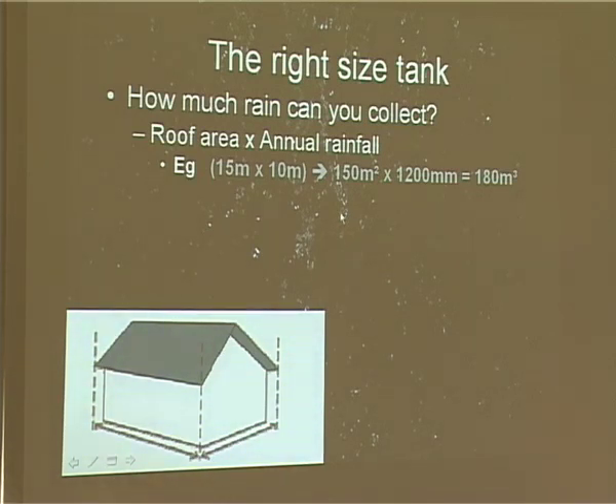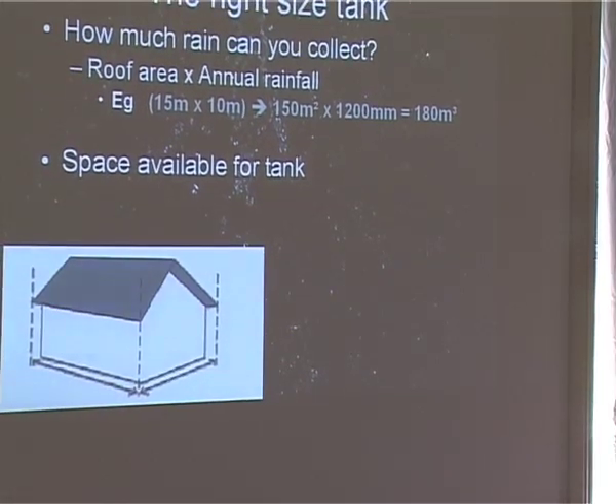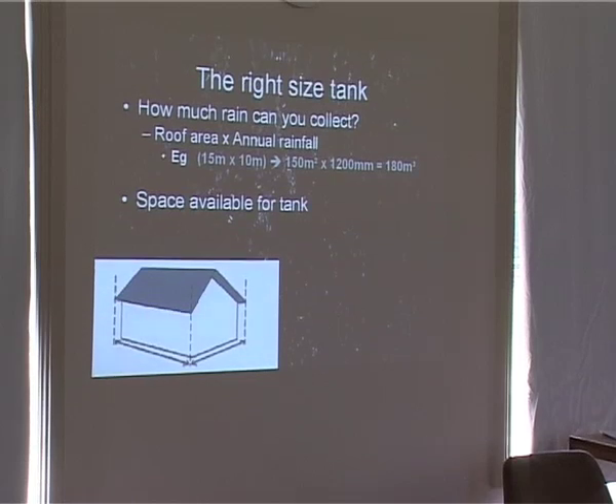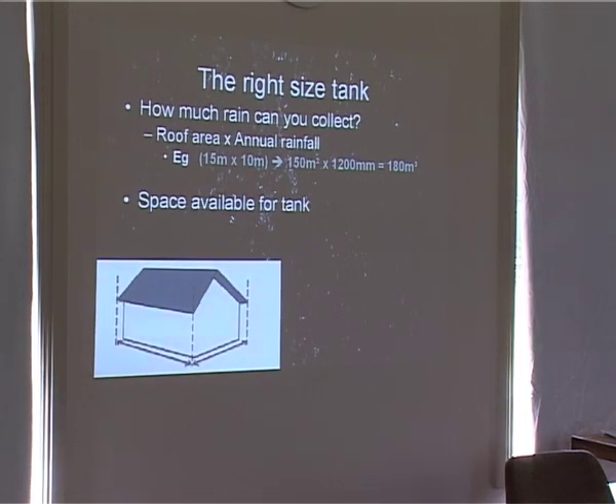If you could catch it all — though you'd certainly lose some. In terms of the cubic metres, just add three zeros, so that's 180,000 litres. When you multiply millimetres by square metres, you get the answer in litres. They suggest you might lose somewhere between 5 and 10 per cent in collection. It's a huge volume of water, and it comes right throughout the year — apart from perhaps late January and February. Compared to other countries, New Zealand has a relatively constant rainfall throughout the year.